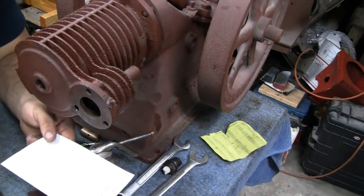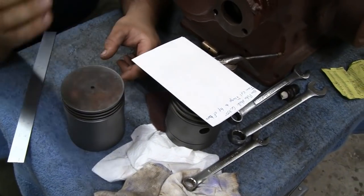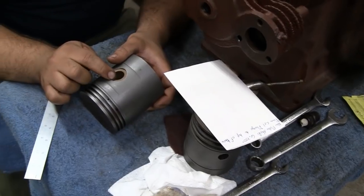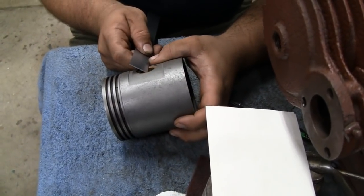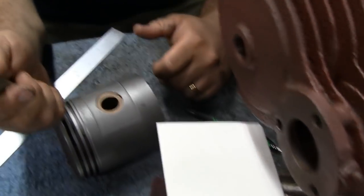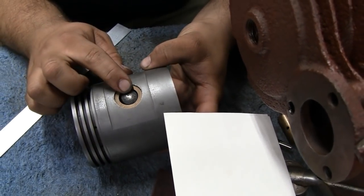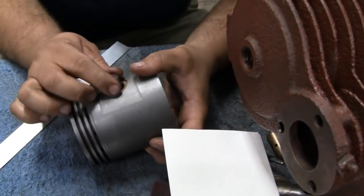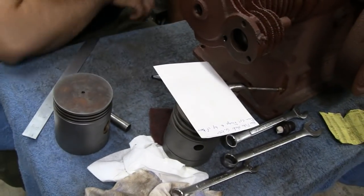We're still going to have to machine the piston a little bit to reduce the diameter so it fits the bore, but we don't have to worry about shortening the piston. We don't have to worry about offset bushings. Right. We're going to have to make new bushings because this is what, a 5/8, 3/4 inch wrist pin bore. Where's the wrist pin? Well, this is the wrist pin. Yeah, look how tiny it is. Stick it in there, Mike. So, yeah, we're going to have to make new bushings, which is not a problem. No. Or we even make the little bushings that sleeve. I probably got a sleeve in there. Right, and we'll see about that, and we're going to be rolling.